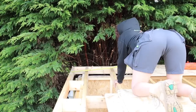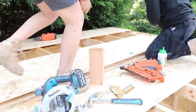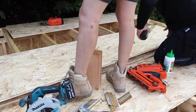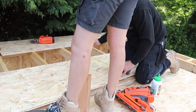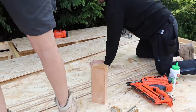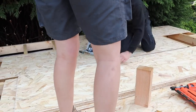Right, 1137. I'm going to use 1137 as my measurement. I'm going to use my tape measure as a straight edge — hook that on there, pull it tight, there's your straight line. The saw is set to a depth of 20mm, which Jen has just set. I'm going to slide that down there — Jen, step off that one so I can get sawing.